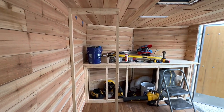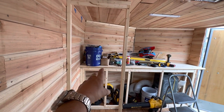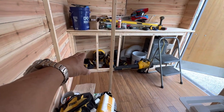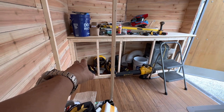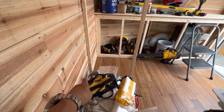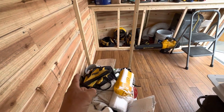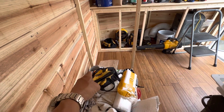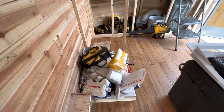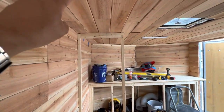The shower wall is right there, shower head going up there, and the shower handle and mixer is gonna go right there. I'll run water line probably from underneath the kitchen counter where the water pump's gonna be, through there. I'm not gonna run it outside underneath the trailer — potential for freezing if I travel up north during winter. So I'll run it along the inside wall using PEX tubing and probably build a box around it to make it look nice.